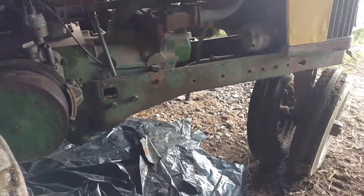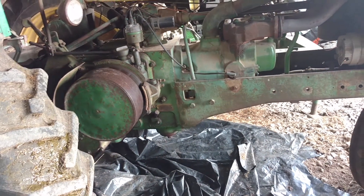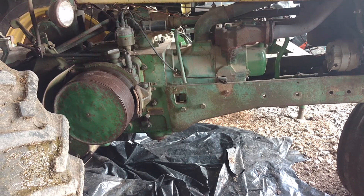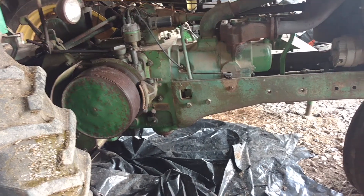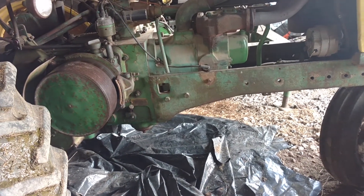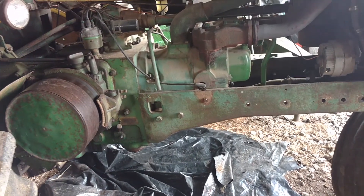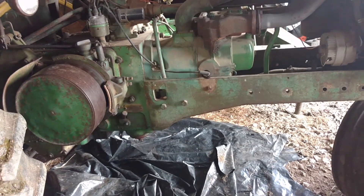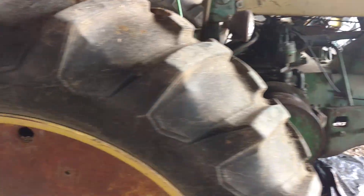When you go from an early 60, 50, or 70 up to a 20 and 30-series, the engine is slightly different. They shortened the stroke and increased the bore. The 60's successor used the same bore as a G-series piston. They shortened the stroke because 1000 RPM was coming — everybody thought 1000 RPM was going to be the standard.